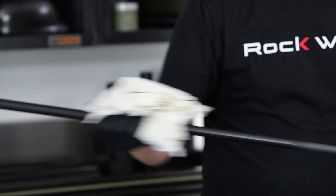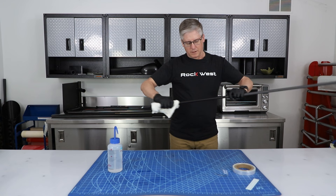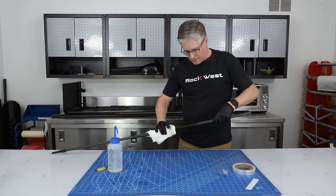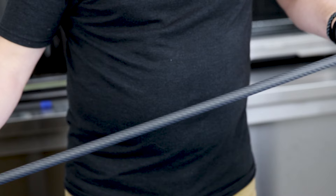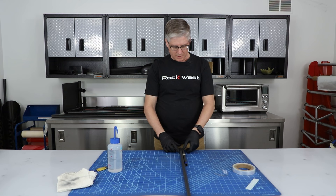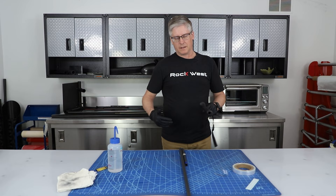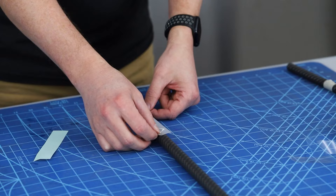We got quite a bit of dust off even though these are really clean. We'll give it a good look to make sure there are no shiny spots. If there are shiny spots we might have to come back in with some Scotch-Brite or even sandpaper. The top tube looks good except for one spot that's got some shiny on it, so I'm just going to take a little piece of sandpaper and give it a good cleaning. Now we are going to locate where our graphic goes. The reason I have it marked out is because when we put our grip on here, we want to make sure the graphic is below the grip and doesn't interfere. We want both poles to be the same distance. This is a two-part vinyl sticker, so let me just lay that down up in the center.